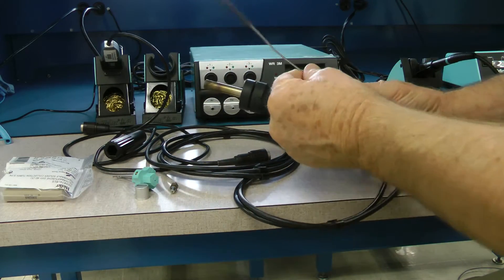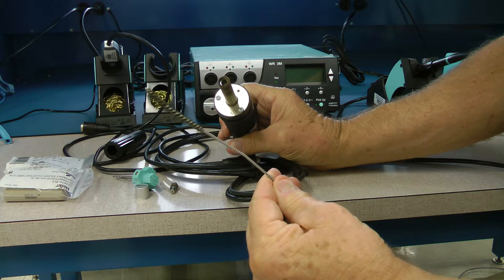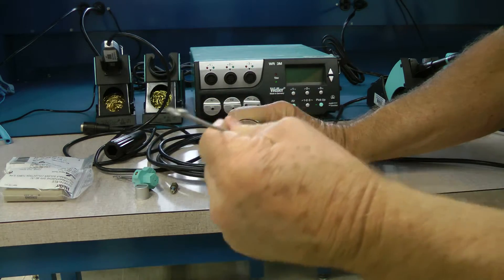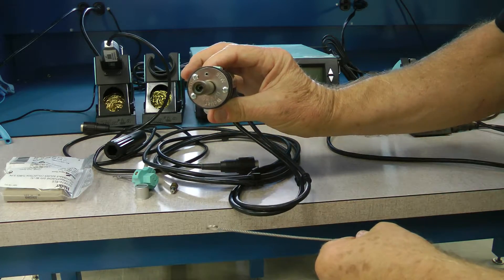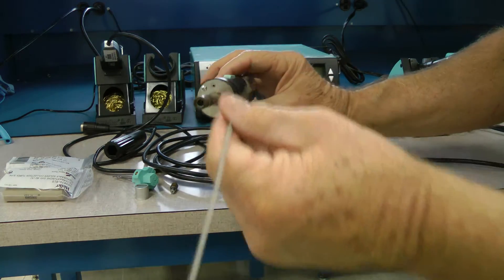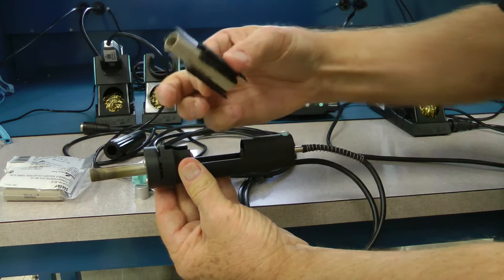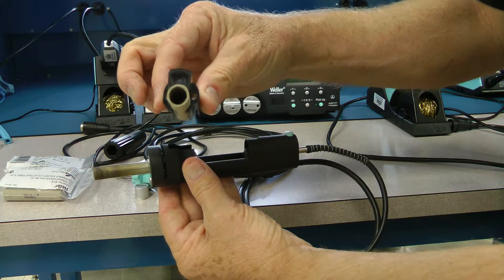When the tool is hot, take a pipe-cleaning brush — a little wire brush — and in that maintenance procedure run the brush inside the shaft to clean it out. That is where you'll get solder accumulation, so make sure you get that cleaned out. Last, slide this back, lift it up, and inside is the chamber where the solder that is pulled into the tool is collected.